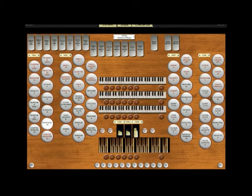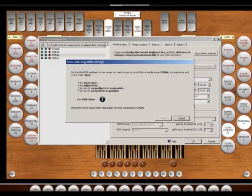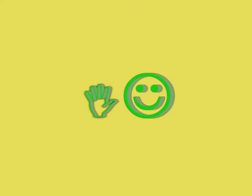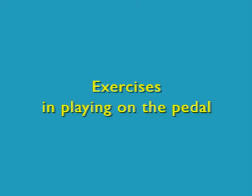The third step is connecting the MIDI signal to the computer, launching Hauptwerk software, loading our favorite organ, switching on at least one pedal register, and configuring the range of our keyboard as shown earlier. And the organ — does it play? We finally must put all the keys permanently in the housing, set all the microswitches to proper cooperation with the key levers, and maybe equalize the moments of switching. And practice, practice, and practice again — in order to come quickly to the level of skill like my favorite organist has. The organist is a young, nice, and promising Dutch organist. Let's see and hear.